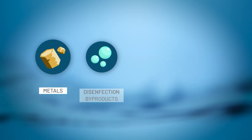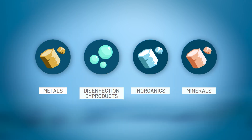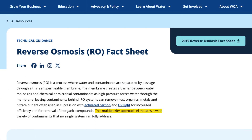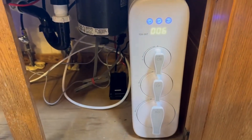With its multi-stage filtration, an RO system can remove contaminants including metals like lead, arsenic, and uranium, disinfection chemicals and their byproducts, inorganics like fluoride and nitrate, and even minerals including calcium, magnesium, and sodium. The Water Quality Association puts it best, saying this multi-barrier approach eliminates a wide variety of contaminants that no single system can fully address. Many modern RO systems also come with built-in TDS meters, so you can check at a glance if your system is still doing its job — especially reassuring when using RO water for drinking and cooking.